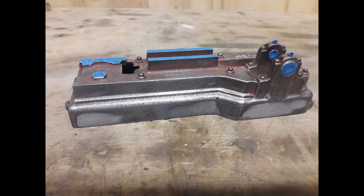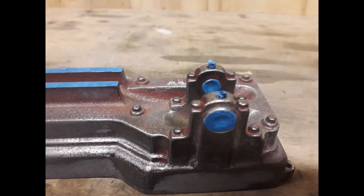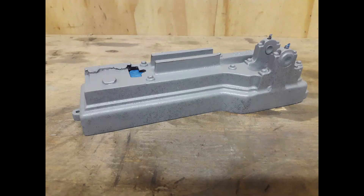We masked it up — do your best to cover all the machined areas, so where the crosshead goes, where the cylinder bolts on, and the main bearings. Also screw up some little bits of masking tape and put them in where the oil threads are. In the past I've even used a bit of blue tack for small holes — just put it in and after you just get a pin and pick it out.